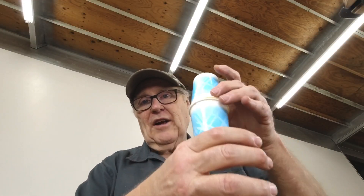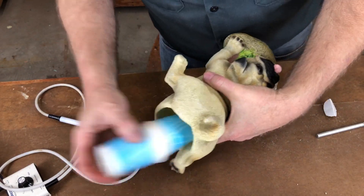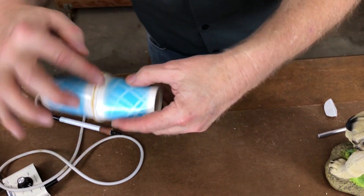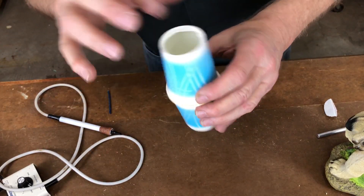This is for the insert that goes inside the cup section of the mold. My original idea was to turn this out of sign foam or some material, but then I realized this cup is exactly the right size. Welded them together with sticky wax, and now I can just fill it with resin — no work at all, which is the way I like it.